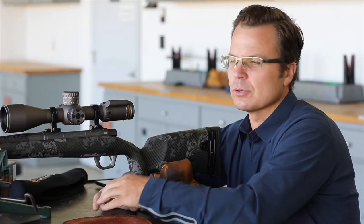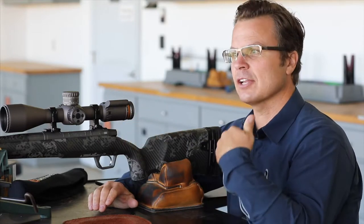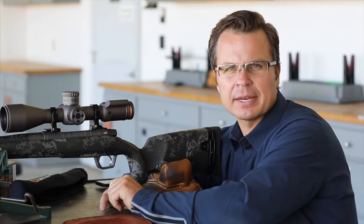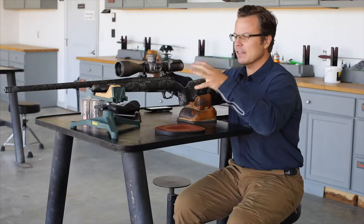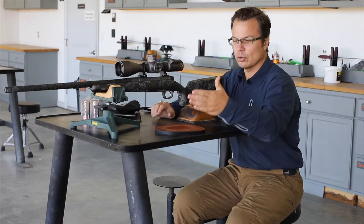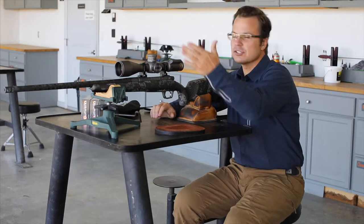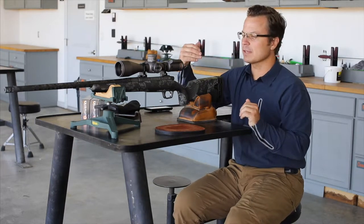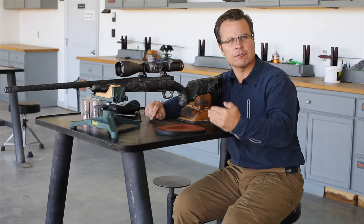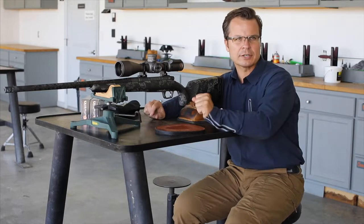The compass is actually a magnetometer, so it's detecting the magnetic field of the earth and it's telling you where you're oriented — north, south, east, west — according to how it senses that magnetic field. Anything that is iron or that has a magnetic field, like a rifle action, the shooting bench, a fence that you're up against, or even something like the battery — all of those things generate magnetic fields and can cause interference with the magnetometer's ability to detect the true direction.